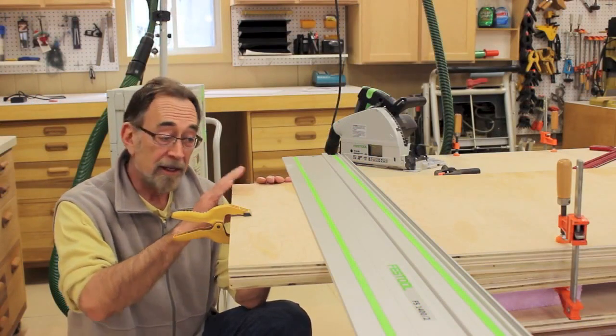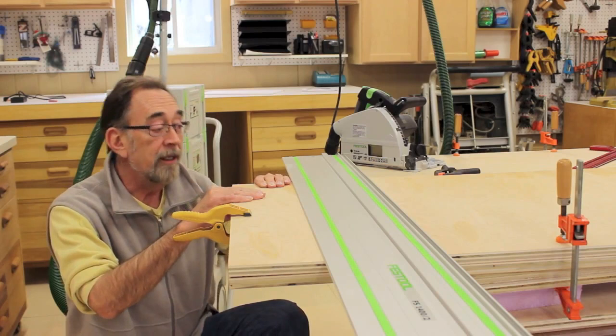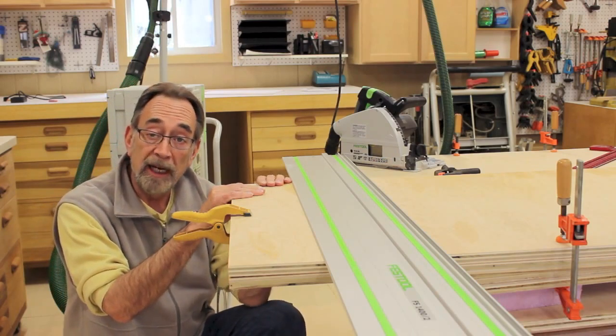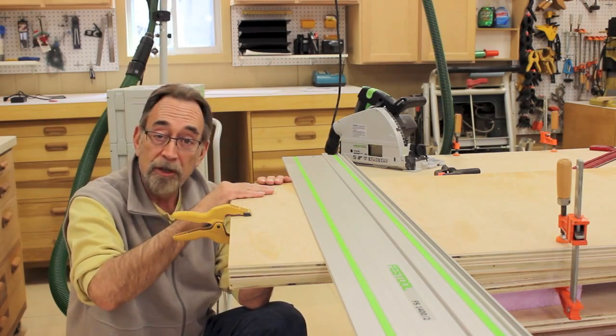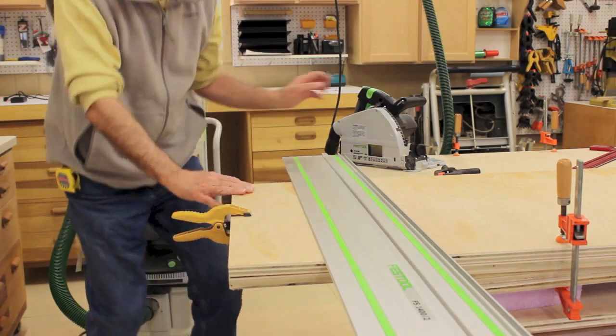That will help me line up the guide rail to get a perfectly square, straight cut right on the mark. So throughout the process, I have kept these boards clamped together in registration. Now, because of the cuts that I've made, I've got 3 perfectly square, smooth, straight cuts, and the only thing that's left now is to cut these boards to 42 inches long. I've marked those off, put my guide rail in place, and I'm ready to cut.